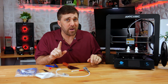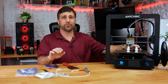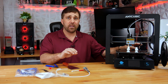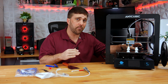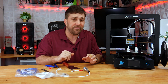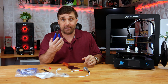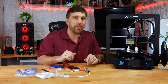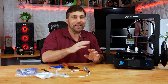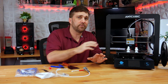As far as setup, that's where I ran into a few minor issues. The first was probably partly my fault — this cable got stuck and tripped the end stop on one side. I should have checked to make sure all moving parts had clear paths. No harm though: I freed the cable and the two sides leveled themselves back out. The second cable issue wasn't my fault. I have no idea why this wire was zip-tied to the print bed leveling screw. I can see why it was secured because free, it can interfere with large prints if the bed travels back far enough, but because it was tied to the leveling screw, I couldn't adjust that corner. Good thing they gave me flush cutters. Finally, leveling the bed did take some time — every time I'd level the four corners, one would be off again. I lost count of how many times I went back and forth, but it did eventually level.